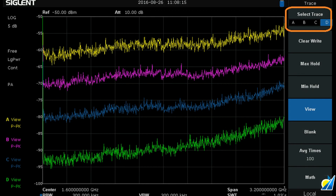The instrument also features the ability to show up to four traces simultaneously — four versus the three available on many other spectrum analyzers. Having the ability to view four traces simultaneously and configure them each separately allows you to compare more of the traces collected using different setups or parameters. You can almost use it as a reference hold similar to an oscilloscope reference hold, which is helpful when troubleshooting multiple scenarios or different measurement environments.